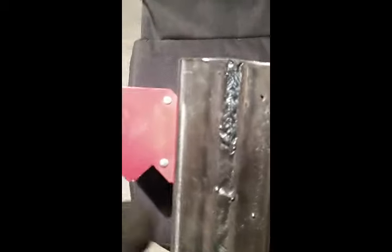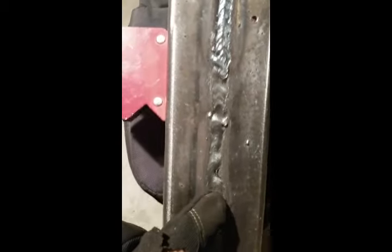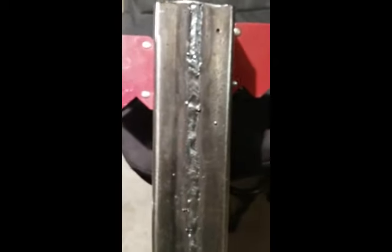Got it all welded up fairly good. Look at that ugly weld. I was experimenting: this is 6010, and then the better stuff is 7014. 6010, 6010, 6010. Look at that wonderful bead work. Oh, and that little nice spot there, that's 7014. That's better, can weld a lot better with that. And that's the 6010 again. But for free, I'll take it.